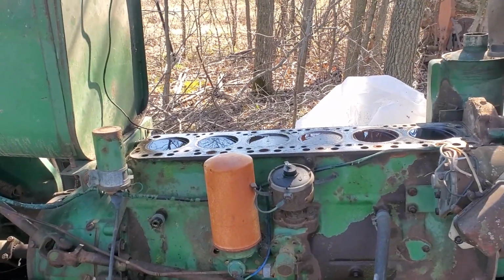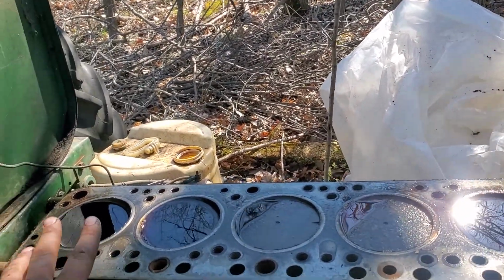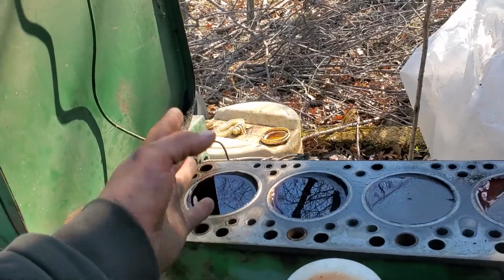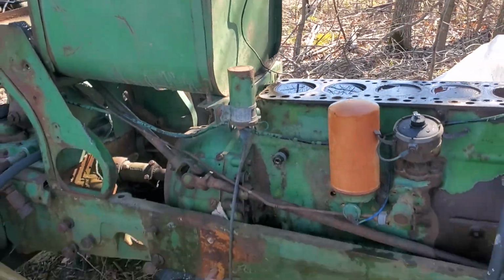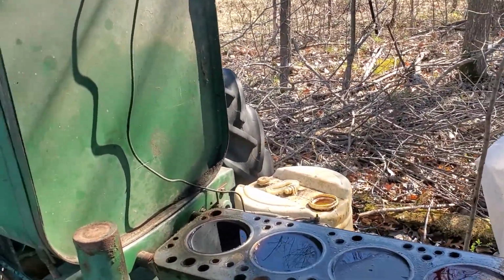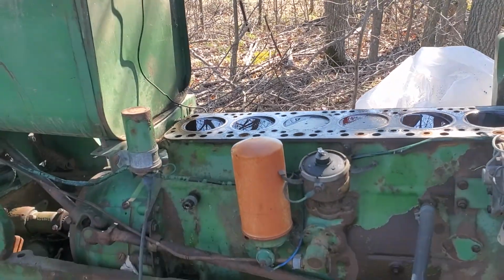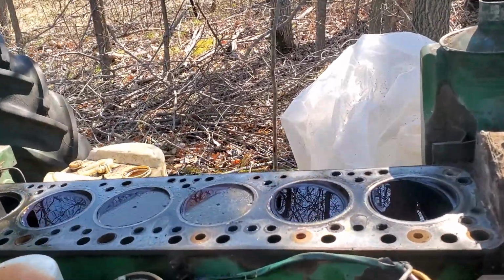It's the cylinders. I think there's three really bad looking, well, not really bad, but three crusty cylinders. These two and that one. And I'm thinking that hopefully with the diesel up all the way, it'll help loosen the stuff on the cylinder walls, and that stuff will just kind of flake off or something. Not be perfect, but be better. I'm sure if the cylinder walls are rusted, it's just going to be no good, but yeah, new sleeves and pistons, but we'll see what we can get out of it. So hopefully that stuff is just superficial and not baked in and whatnot.